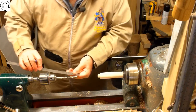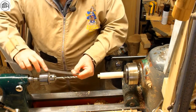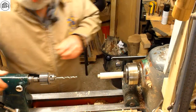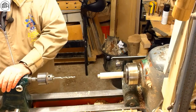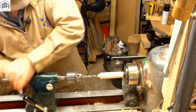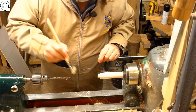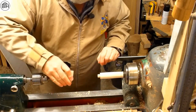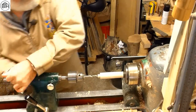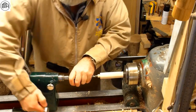So I'm putting a mark down about 100. And 80 or 90 on the drill bit is just past where the lands and grooves finish. So I'll wind this back in. Hold on to the chuck as you withdraw it, and by doing that, that ensures that the chuck stays within the Morse taper in the quill. And then wind it out.